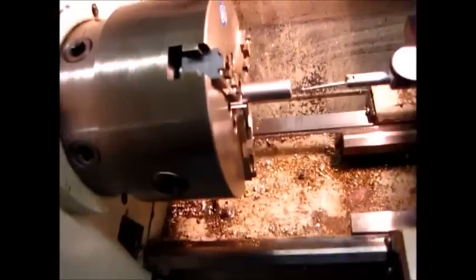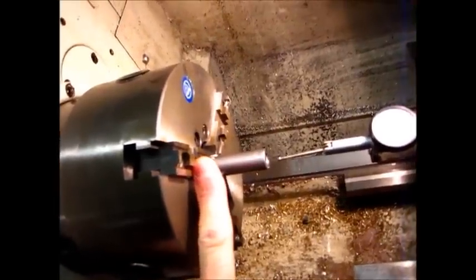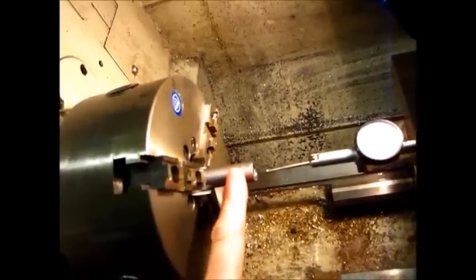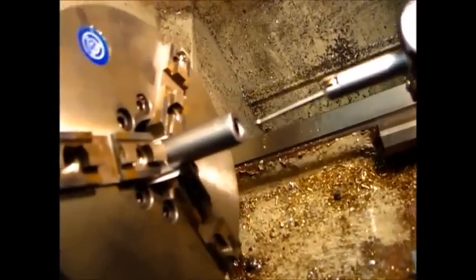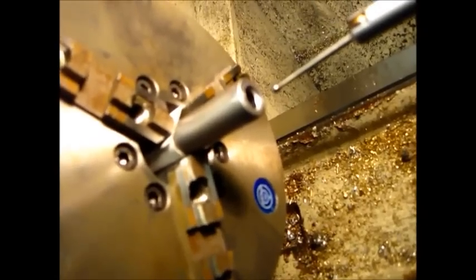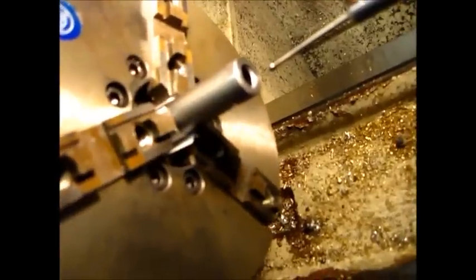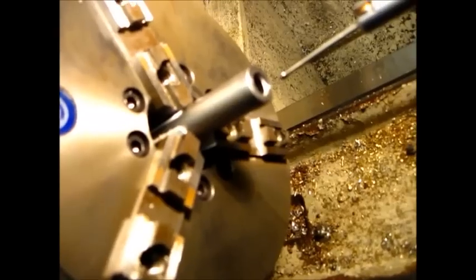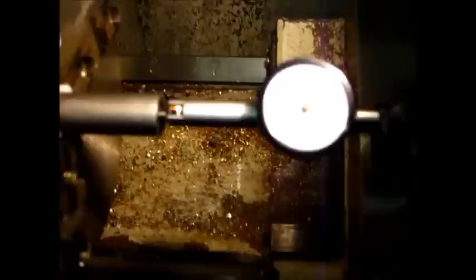At this end I wanted to use a four-jaw chuck to chuck the barrel up as accurately as possible. However, the jaws come out too far and don't leave me any barrel left to work with, since I want to chop off about three quarters of an inch to get to the good lands and re-crown. What I've done is used some paper to dial indicate the barrel in - the paper works pretty good, but it's about two thousandths inch thick, so if you really want to get close you need something thinner like cellophane. It did work out well and also protects the barrel from the jaws.